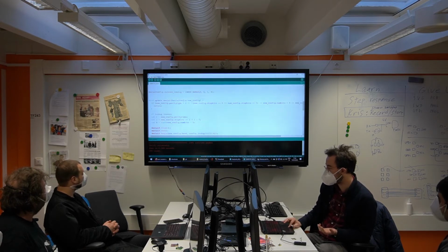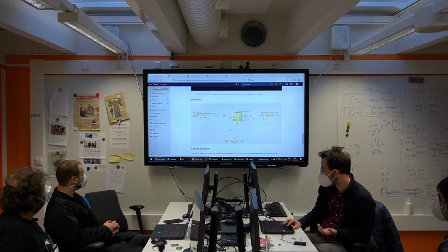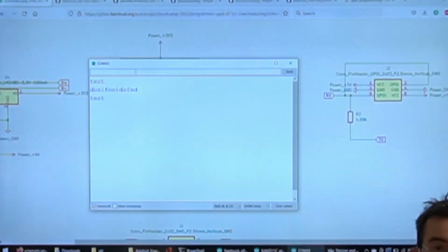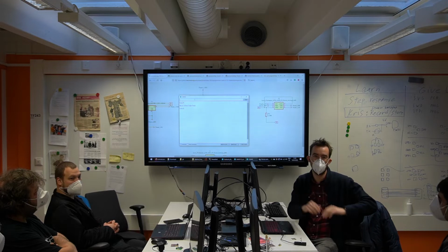So one thing we could do is go to the serial port and let's think about it for a second. We have RX and TX connected together with a resistor. So if I send data, I should see it coming back, right? Let's see. Yes. So I think the text here is going to come back. And the amazing thing is you can change the baud rate to whatever, and it does work indeed. It looks like nothing changed, but if you look at the scope on the hardware pins, you will see the baud rate indeed has changed.